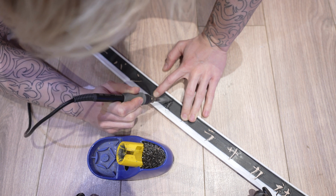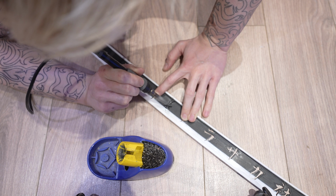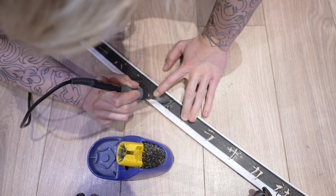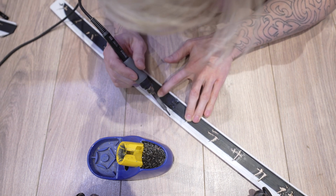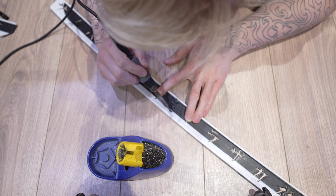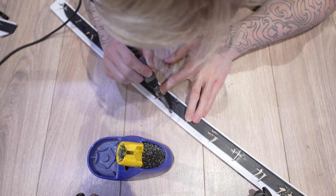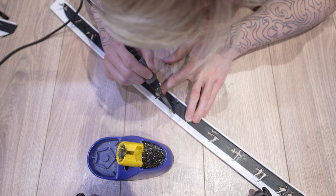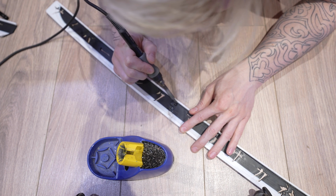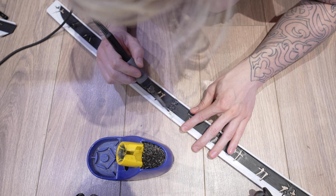And now it's a point of neatening it up, because I like to make sure I go through quite a lot of it, like a few millimeters, so that the weld is deep, not just surface layer. Because this is the functional item, holding the sword in place. And I need to make sure that no area is raised more than it was to start with, otherwise the sword isn't going to slide in.